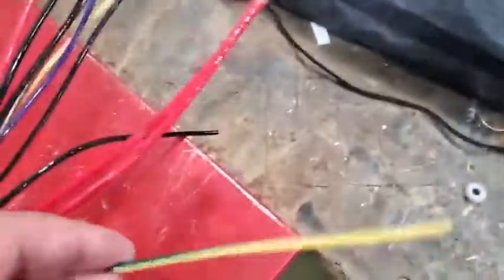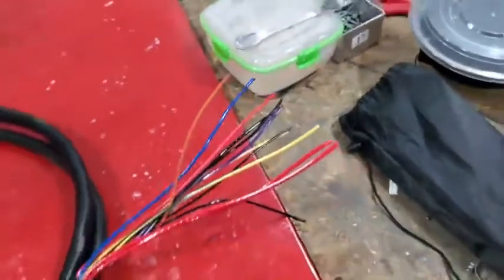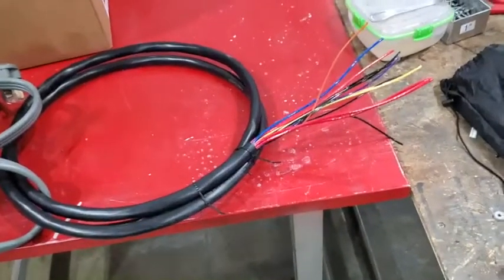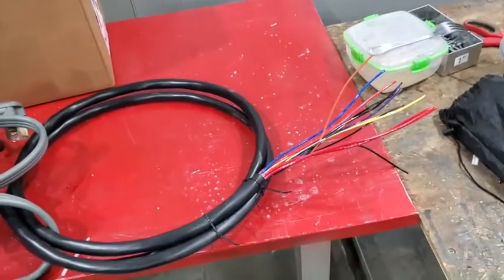This wire with a green stripe is a ground — that is the international symbol for a ground wire, that's why we use it. Pretty simple, pretty basic. And also remember when you're hooking up your power vent, it hooks up into the control box, and the fans get wired separately on their own breakers.